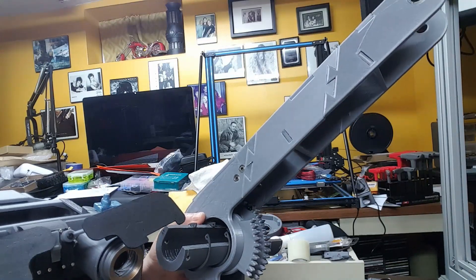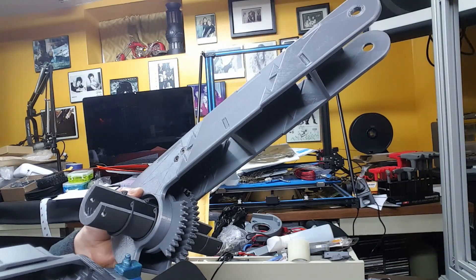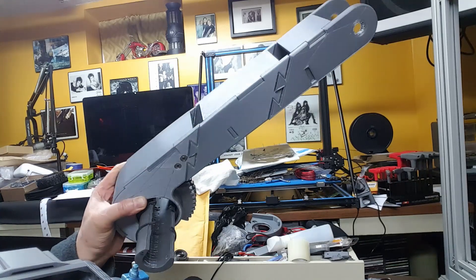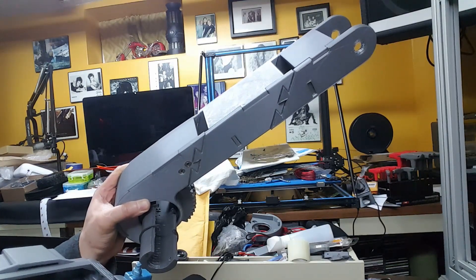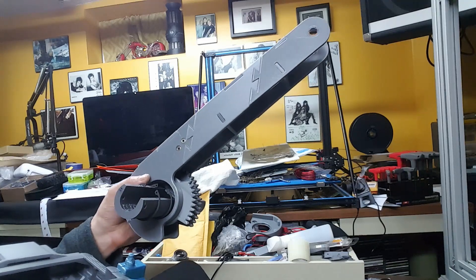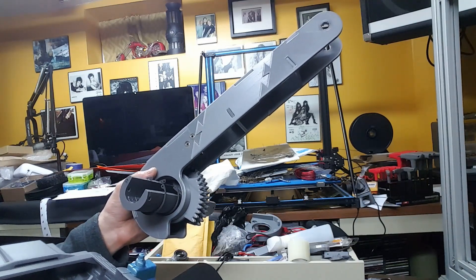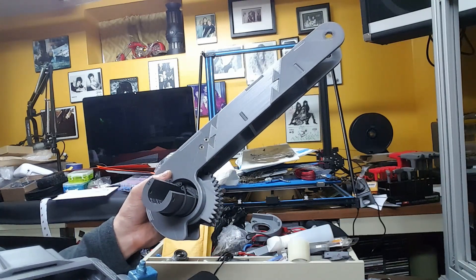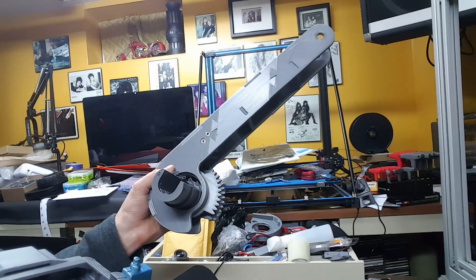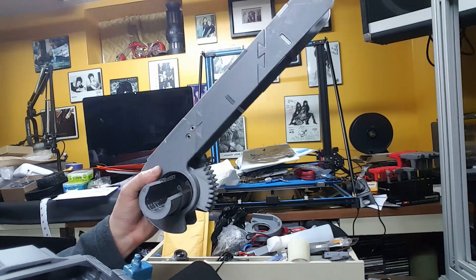I managed to print the bottom portion of the skeleton body. This thing took about six days to print — this thing is huge. This is just the bottom piece; I haven't even started printing the chest yet. I still got to do some mock-ups and some measurements because the bearings — I can't find anything that's 50mm bore with a 60mm outer diameter. So I'm going to have to either make the bearing or come up with some ingenious invention to make those bearings fit in that hole, which right now is only 58mm. I don't think I can drill it out; I'm just going to have to make it fit.